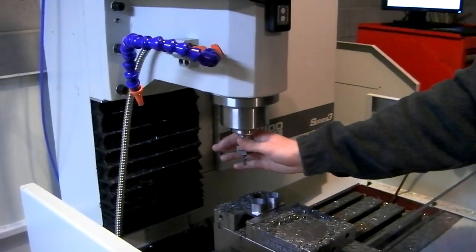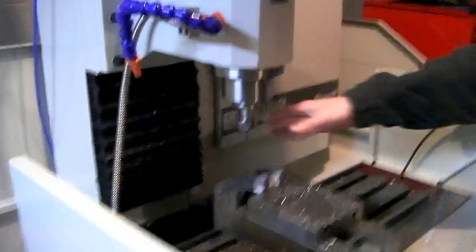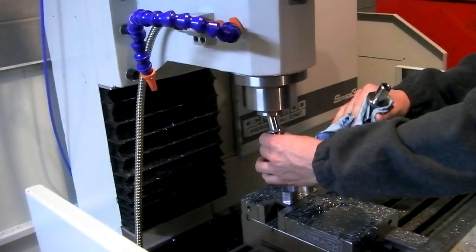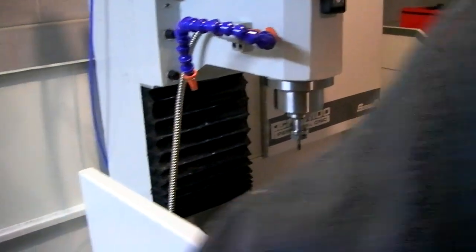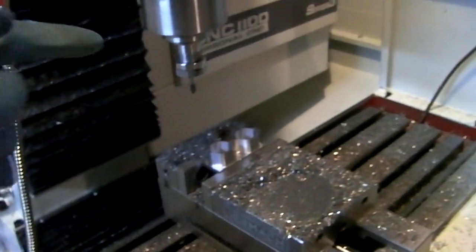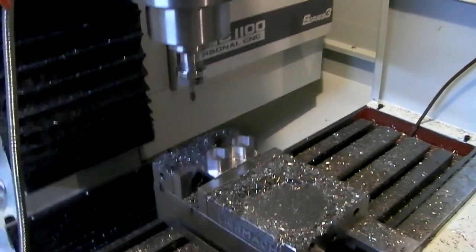That's hot. Too hot to hold? A little bit. There's a towel here if you want. One second — tool change. Booyah. So the machining is done now. Let's see what it is — it's just a series of hexagons, so that I could get a lot of material gone. This is just a chamfer mill; I'm going to go in and chamfer all the corners.